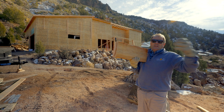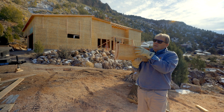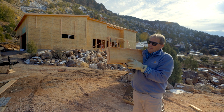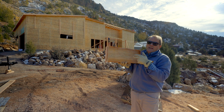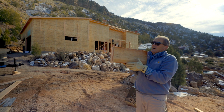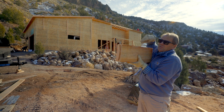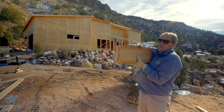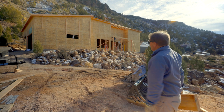And then the trellis was going to come off this way. I'm not going to land it on here. I'm going to attach it right here. Now my engineer may have an issue with that and make me put brackets on. If that's the case, I'm just going to put an L metal bracket all along the bottom of that, lag that, and it will help support those on there. But we're going to use structural screws to hold that in there. I couldn't put it on top here because then it would show the OSB behind that, and I couldn't get behind that to put stucco on and have a finished look. So I'm having it level, and then I'll put some L metal on the top of this, right like that. So you can see that's what we're getting installed now.